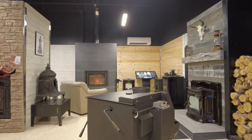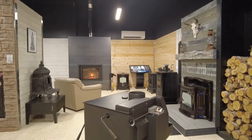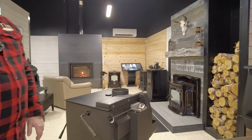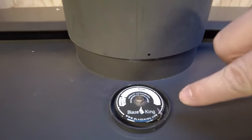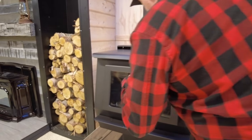Because we're left on about medium draft at that 4:30 position, homes often don't decrease in temperature overnight — unlike secondary air stove counterparts that are shut all the way down all night to achieve a long burn. Here on our stove you can see it's fully loaded with wood and fully engaged, with the catalyst thermometer way up in the active range. I'm going to take it from the three o'clock position to the six o'clock position to demonstrate — there are no visible red coals right now.